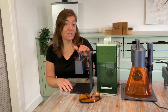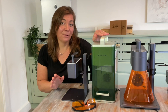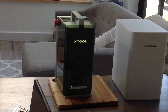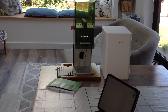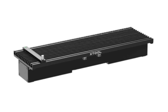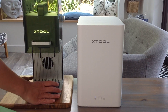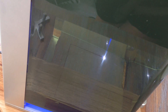As it's small and portable it can also be taken to craft fairs and do projects there in situ. I also have the LaserPecker 2 and the LaserPecker 4, but having the air purifier with the F1 is an absolute must for being able to use it inside my home. The work area is 10 by 10 centimeters, but there is a rotary attachment for tumblers and a slide extension enabling us to work on larger pieces. This is a dual laser with a 10-watt diode laser and a 2-watt infrared laser, which is definitely its secret weapon enabling a fibre laser engraving process.